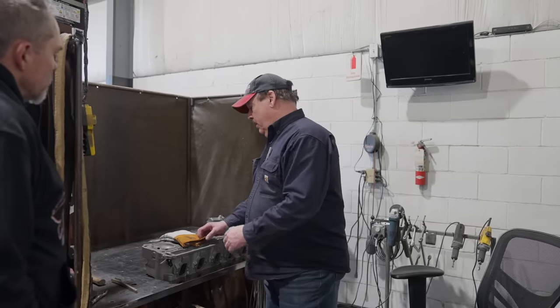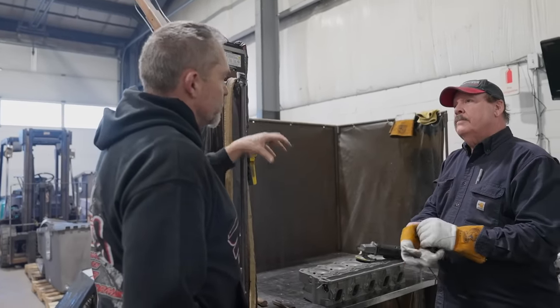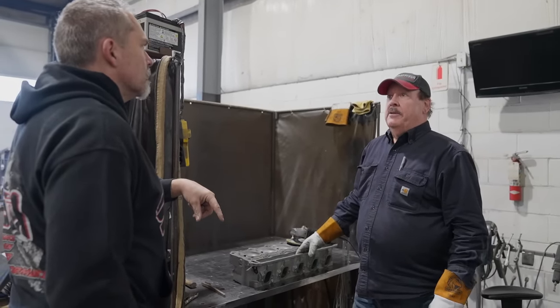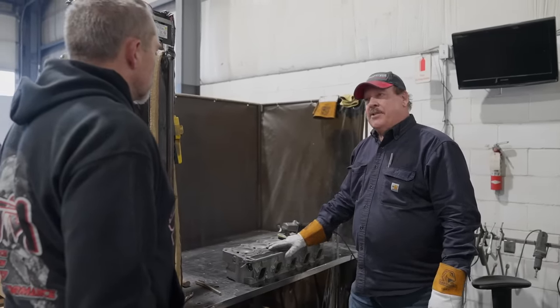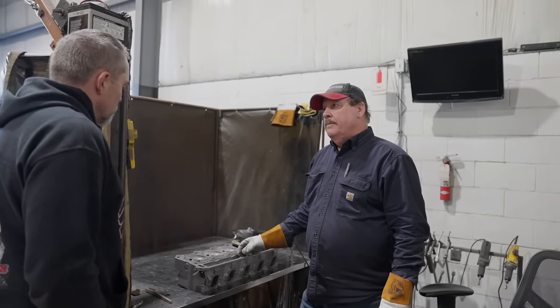Okay. Yeah. I thought that the helium just allowed it to be hotter. It does. But does it help with the cleaning and stuff, or is it just because of the heat? It just induces the heat. Yeah, the heat sheds off that oxidation quicker. Okay, gotcha.